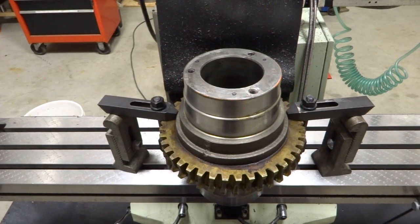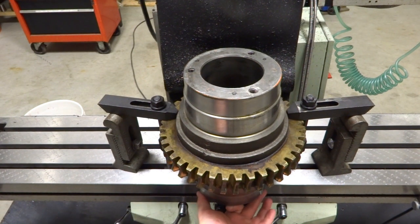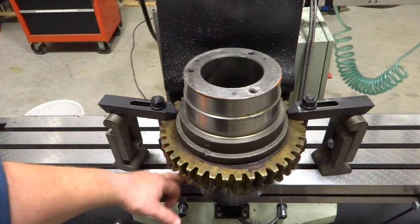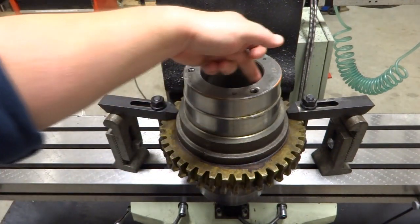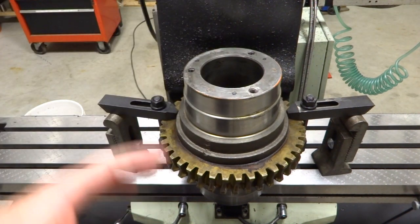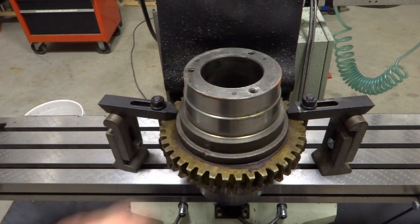It's mounted to the table with the two bolts touching the edge. I've confirmed they're up hard against the edge, it's clamped and sitting flat. I've picked up the center of the shaft — I've moved out just so the lighting is better for the camera, but I have the center now. Now I can enter the coordinates into my bolt circle function and set up to drill these new holes.